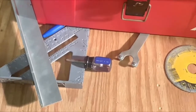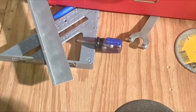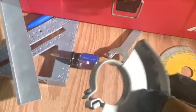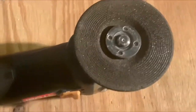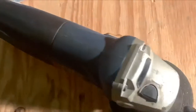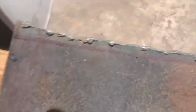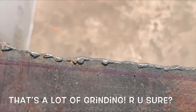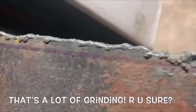With this application, this grinding wheel is too big to have the guard, so the guard has to come off. That means we have to be super careful when operating this grinder. We're going to use that grinder, follow that line, and square that off. Then we'll come around the side.